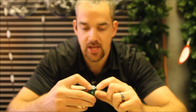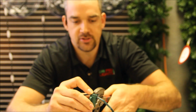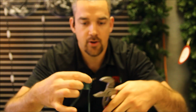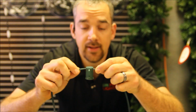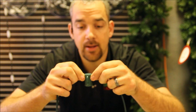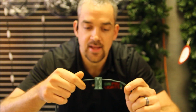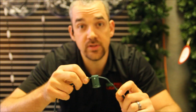So I'll take my channel locks and squeeze it on that side, so that's pushed down, and then I'll go over to the other side and push that part down. So it's really simple to move a plug. You'll just need the replacement socket, because once you remove a plug from the cord, you won't be able to use that plug anymore, but you can just put another socket on there. That's a nice easy way to replace a socket or to move a socket.